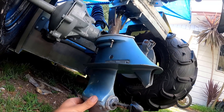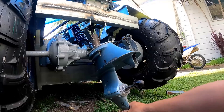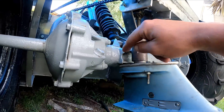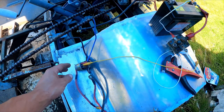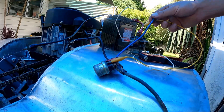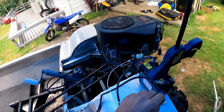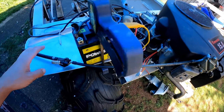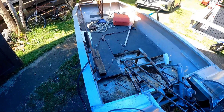The outboard lower's mounted on there. There's a universal joint here, and the pivot is the same angle as the universal, so it can hopefully move up out of the way. When the axle's all the way up it'll go all the way down. I'm just going to trim this back a little bit. Trying to hook up the electric starter — I've got this old mower solenoid but I couldn't get it to work, but this little one here seems to work alright, got it dodgily wired up. This engine's got a little pulse pump on it, so I swiped a fitting from an old outboard to use the boat fuel tank.